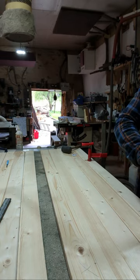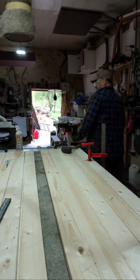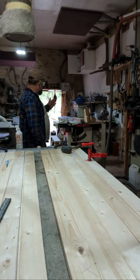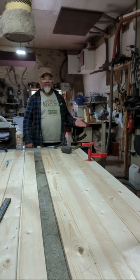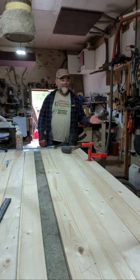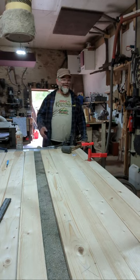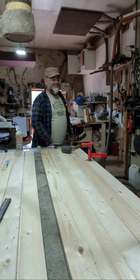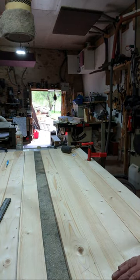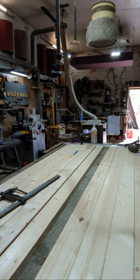So, yeah, and also these cheap saws with the riving knives on are rubbish. They're so thin and floppy, not mounted properly. The biggest problem with that one, wouldn't say the thickness of the riving knife, it was the fact that the riving knife doesn't go up and down with the blade. So if you want to do a blind cut, like cut a rebate for a door frame or something on the table saw, you can't do it, because you've got to remove the riving knife anyway to be able to do a blind cut. That's stupid. Stupid design. To be fair, I bought the saw secondhand years ago, and I didn't actually realise at the time that it was an issue.